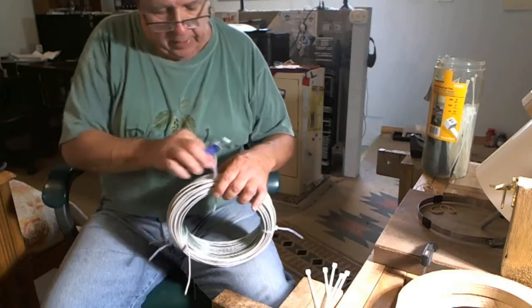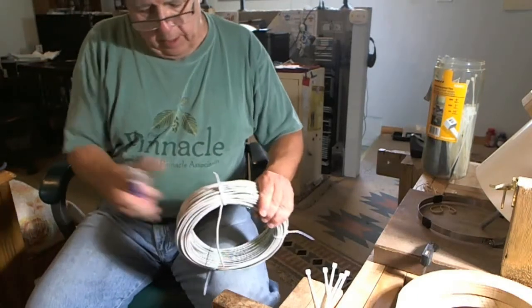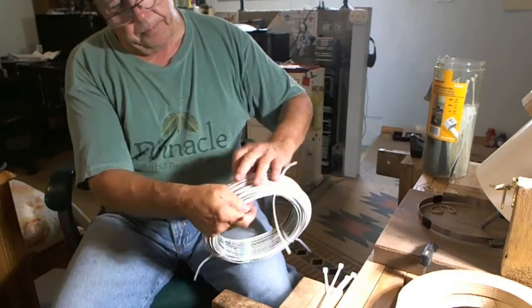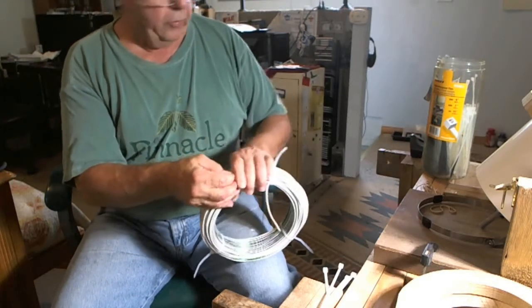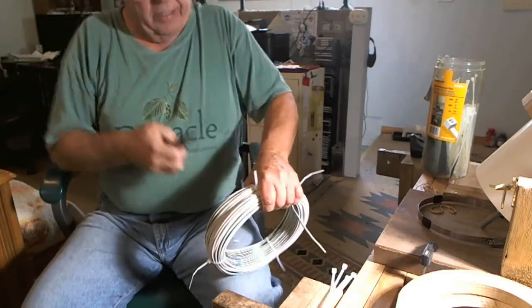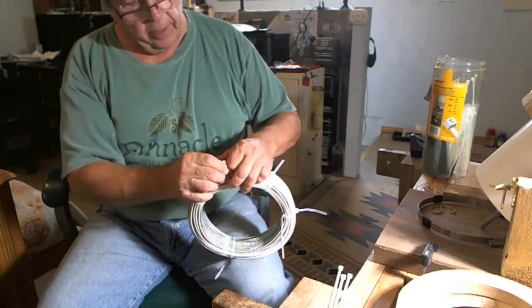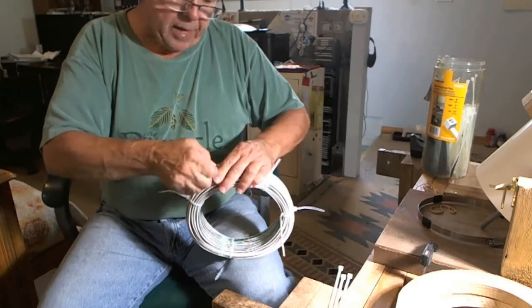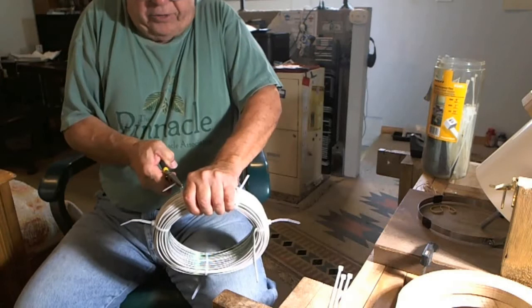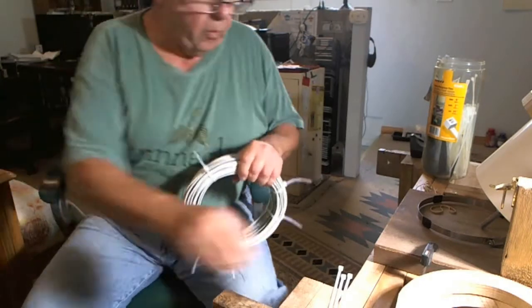Here's where I pull all the wires tightly together. The tighter I can pull them, the less chance that you'll hear a buzzing or transformer sound. And they're all pulled nice and tight together. So this is how I make a coil. Now the monocoils are unbelievably much easier to make — they wind real easy because I'm not trying to hold two wires together. There's less peripheral stuff, and I only have to make one cord because I only have one winding.